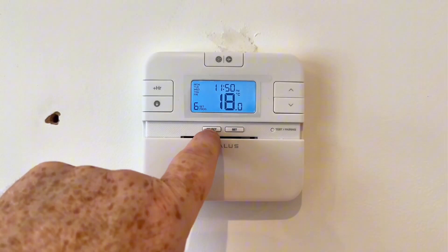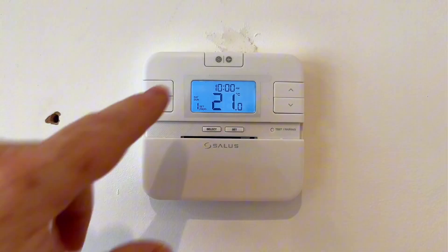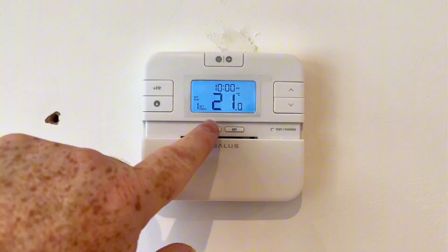Just remembering that this is going to go back to the setback, so it may be you don't want the house to go totally cold overnight - you might want to set it to have a setback at 18, so if it goes below 18 the heating would still come back on. And then you can set your Saturday and Sunday separate. I hope you found this video of some use - if you've got any questions please put them in the comments below, and if there's any other Salus products you want me to do videos on, put some comments below and I'll try my best. Thanks for watching.